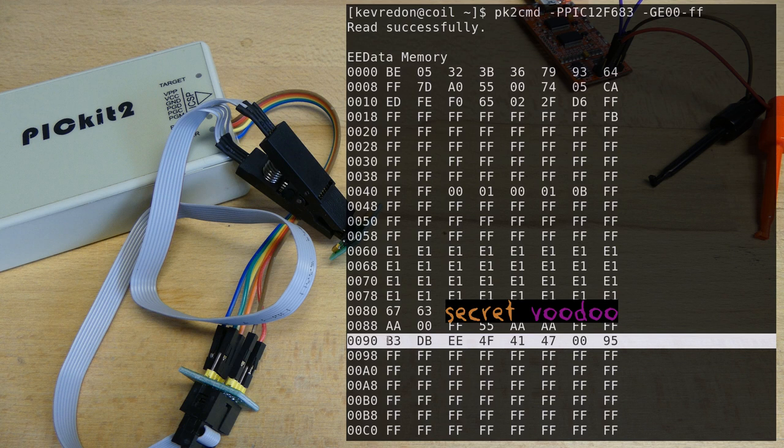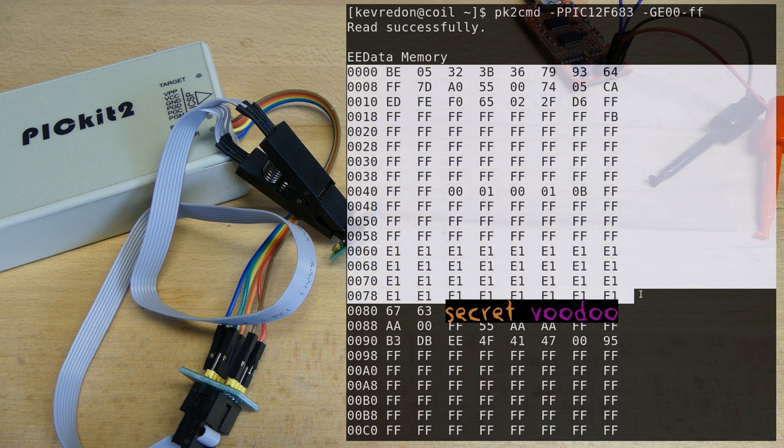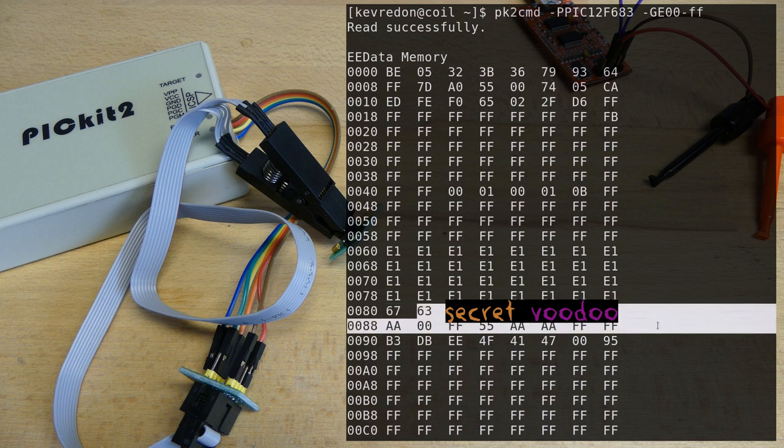This is the ROM ID which we just saw of the EEPROM, and it's at the right address. And also, if you look at the remaining data, it is the same that we dumped over one wire. But here is a difference. At address 0x80, where the secret should be, it is there, and it is here in clear. This time, it is not encrypted. And this time, we can completely read out the key.